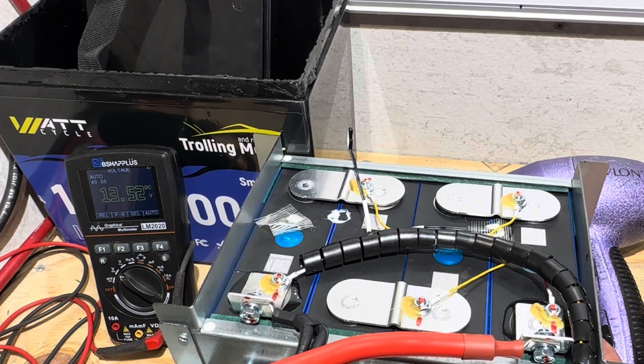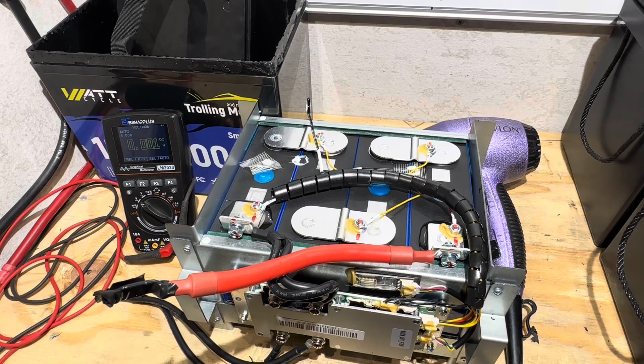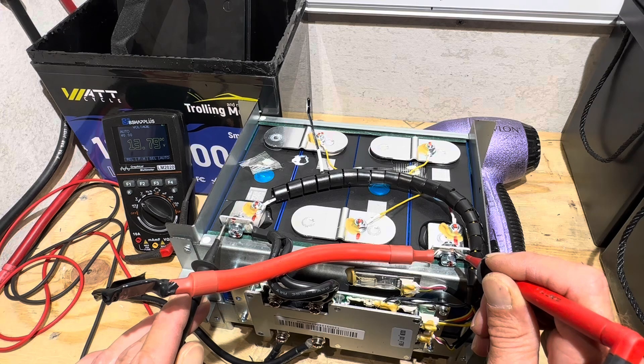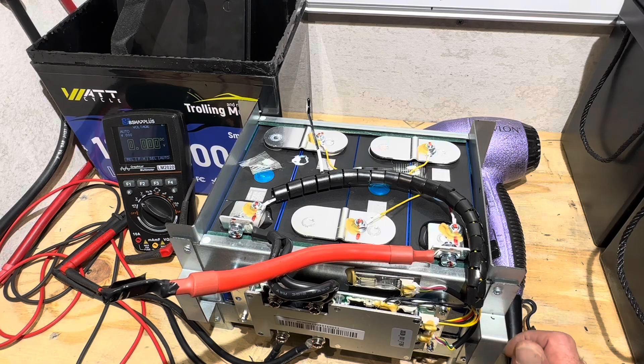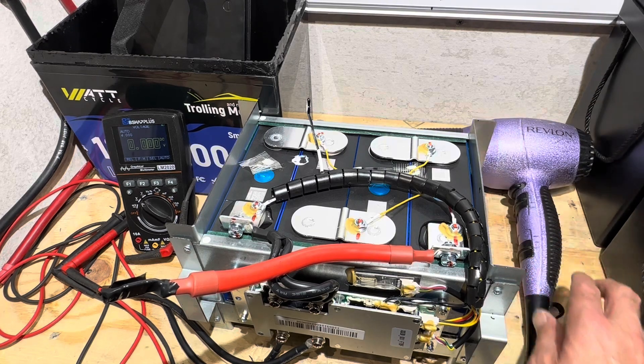I triggered the safety on the BMS — the voltage spiked up to 13.7V and then came right back down to 13.52V. Something in this BMS I don't like. The pack itself is reading 13.79V, and you saw it spike when it came back from high-temp protection. I think there's some kind of resistor in this BMS causing the output voltage to be regulated down. I need to pull this apart further and investigate the BMS circuitry — that'll be another video. Until I figure out what's going on, I can't recommend this battery yet. I'll investigate further and give you an update as soon as I can. Thanks for watching, have a nice day, and be safe.